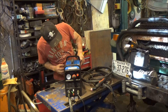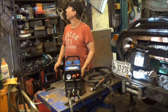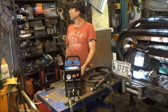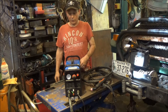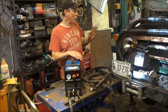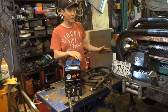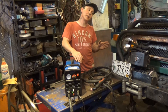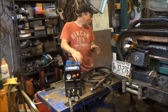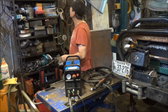So the plan here is to pop this thing open, change out the cord for an ordinary dryer cord that I can plug into my welder socket which is 220, and then see how the thing cuts. I've got a whole bunch of fab work to do that involves cutting 3/8" plate. This thing will cut quarter inch pretty easily as-is, but 3/8" is iffy and it really won't cut half inch well at all — it wanders through, makes a huge mess.